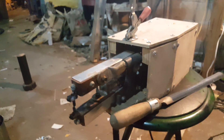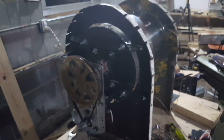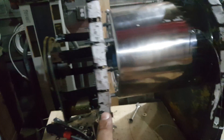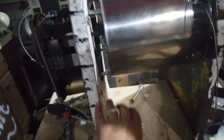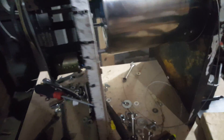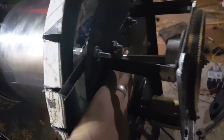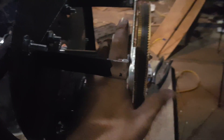Anyways, that's my video for the night. I did make some modifications to the coffee roaster. Primarily I moved it back one whole inch because the elements I ordered are nine and a half inches and I need some space to make brackets underneath to hold them up. I also put a heat plate to help guard my motor and assembly from heat a little better.